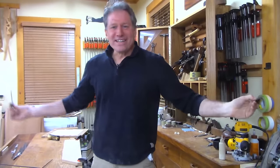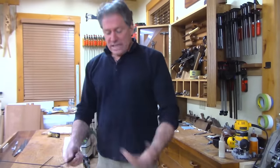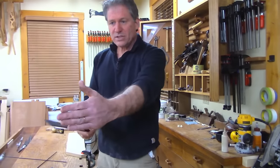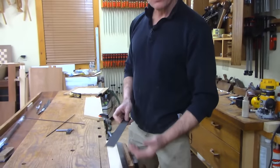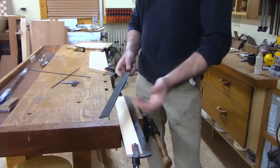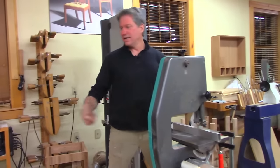See how civilized this is? Plus you don't have to keep turning on the joiner and you don't have all that noise. I'm going to skim here — I could advance it and take a little more off, maybe dial it to do it in two passes. That would be awesome. All right, let's go back over to the bandsaw and make one more line, and then we're going to start inlaying. I'll show you a little bit of inlay.